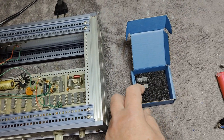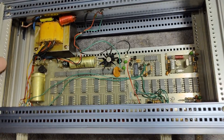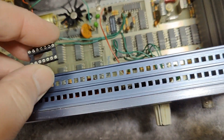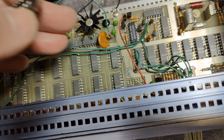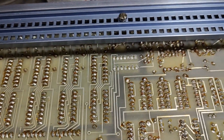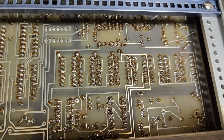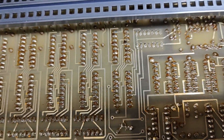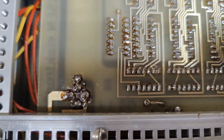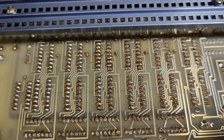Now it is a few days later — look what I got. Thank you very much, Peter, for supplying. I think I'll put in a socket so we can try a little bit, because the new one is an LS variant and I think the original didn't use LS — there's probably something with speed and trigger levels. Let's try and see what happens. Notice the difference between cleaning after you're soldering: here's my little cleaning, and then you can see all the original solderings — how nasty they look. Some of them are quite bad. You can use either alcohol or acetone; acetone is more effective but smells really bad — definitely super effective.